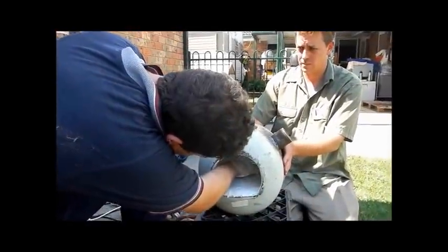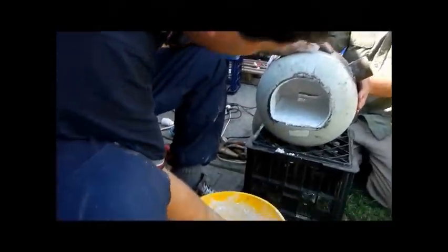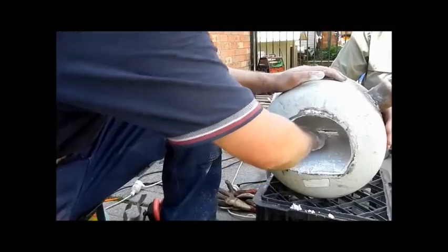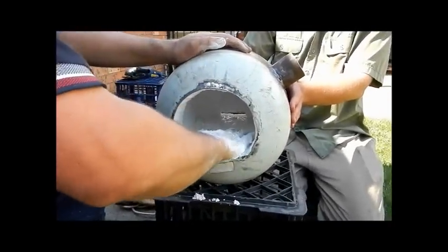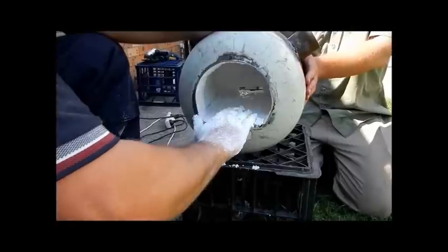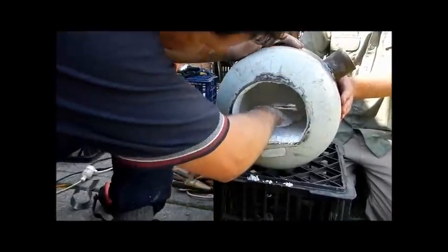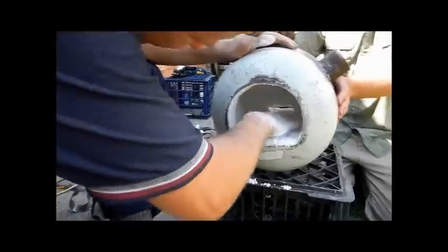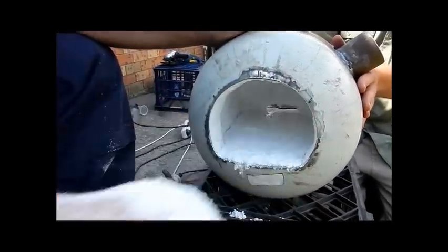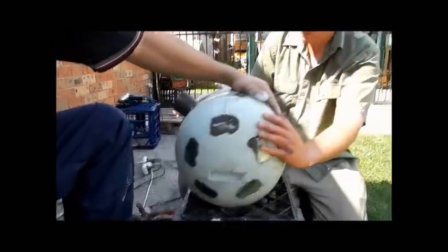Alright, so what we're doing now is putting in the floor, which is essentially very fine grain, castable, refractory. As you can see, it's like doughy sort of stuff. It's like dough. Give it a good wobble and get all the air bubbles to come up. Okay, spin it around, we'll do the back. Keep it flat now, because otherwise it'll just run around in there. Right.